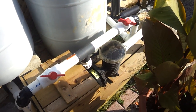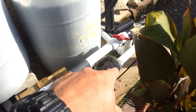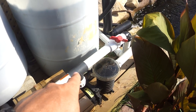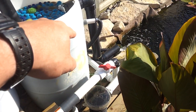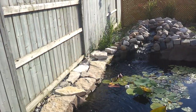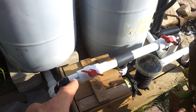That pipe carries over to an Evolution ES 4500-gallon pump. The discharge T here is where the discharge comes out. It goes down to a two-inch ball valve and then underneath and under the ground all the way up into the waterfall. The line to the left goes into the filtration system.